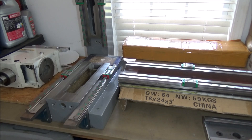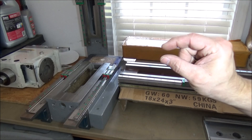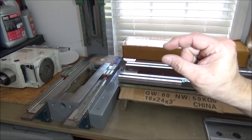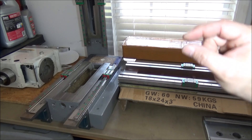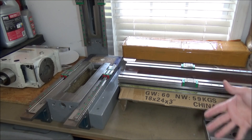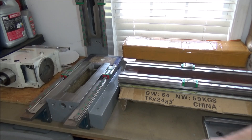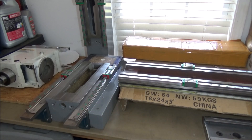You've got to bear in mind that at least on the base and the column, you've only got about — maybe maximum three-eighths of an inch that you can thread into. Some places a little thinner, some a little thicker. You have to keep that in consideration, because if you machine down your surface there for a datum, you're going to take away from that.